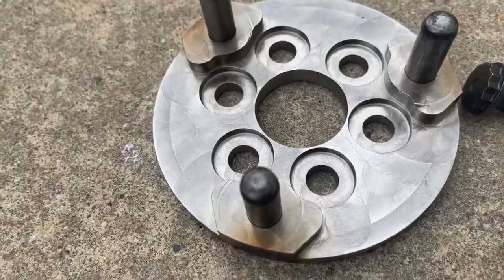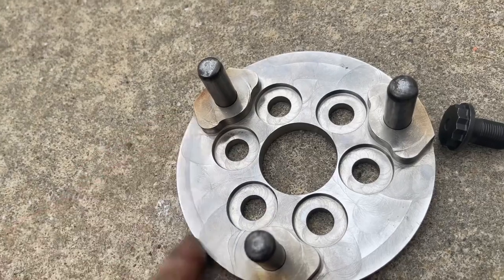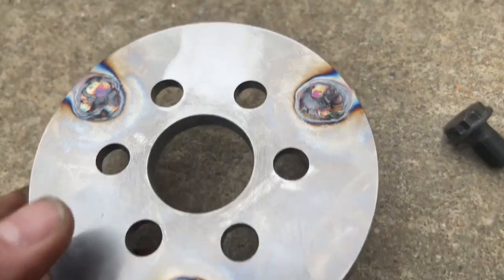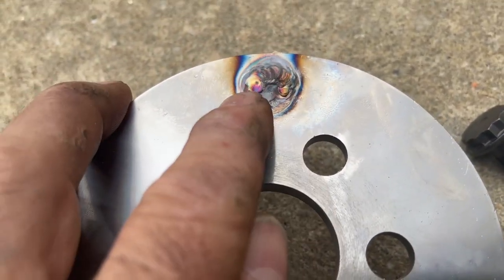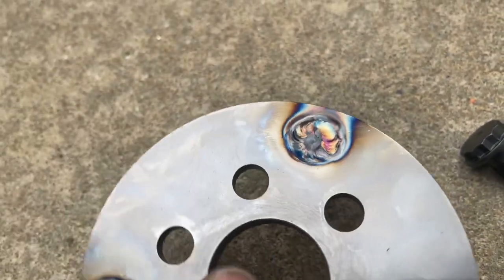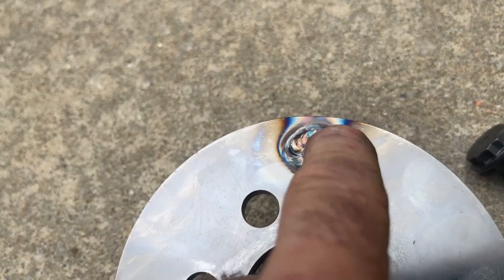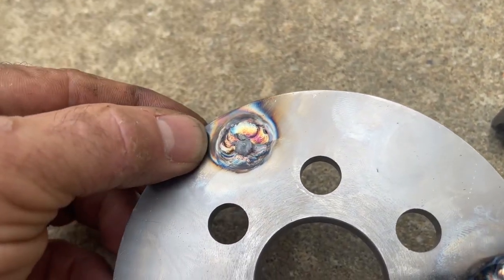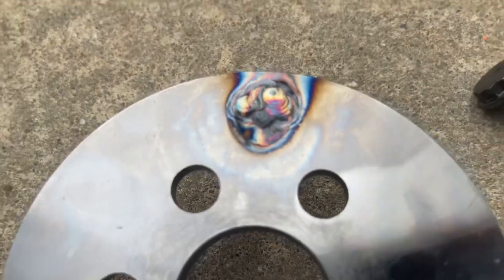The drive flange will have the dowel pins in it. Counterbores, like we said, have to be circular, not triangular. On the back side, you can inspect the welds. The welds will be all the way around the dowel pins, and they'll make sure they're flush. This half of the weld is always flush to clear the flywheel. And then sometimes there's an additional bead put on the outer half of the dowel pin to add a little bit more weld. So you would just take a magnifying glass and inspect the welds for cracks.